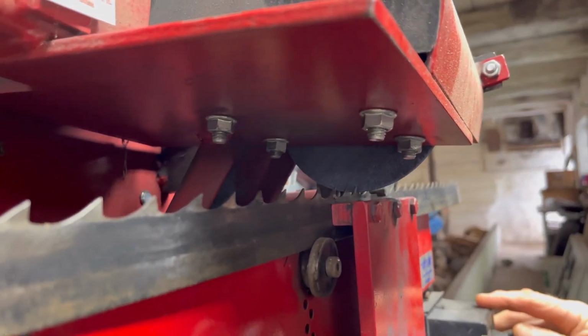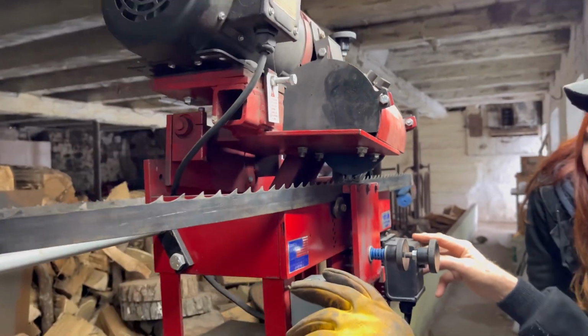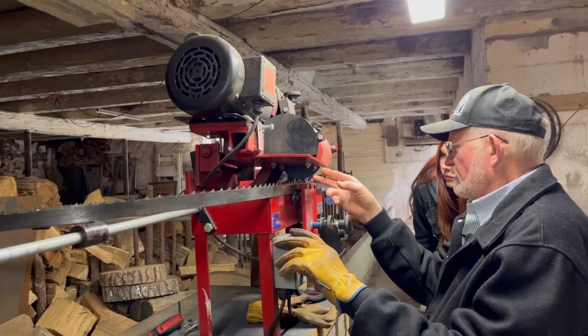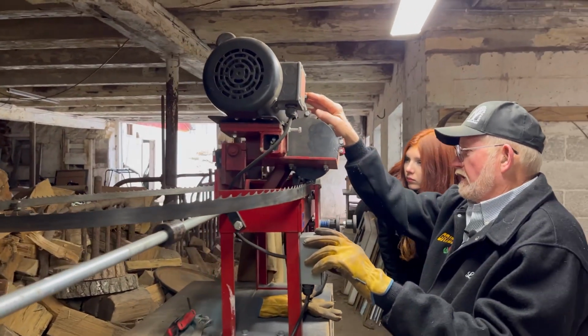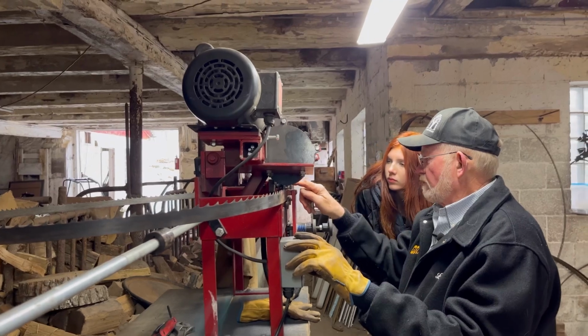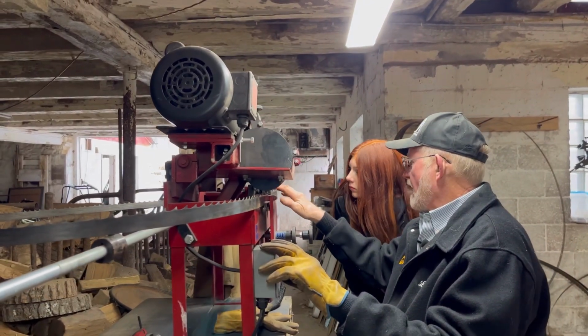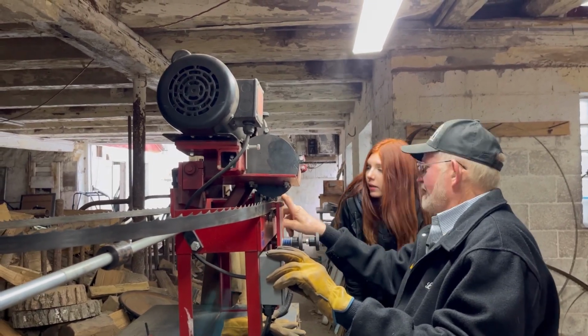Okay, that looks good. Now I'm gonna turn it on and I'm gonna let it down, and I'll adjust this arm until I'm just catching the bottom of this, and lower the stone enough that I sweep up on the backside. That keeps all your teeth the same height, because if you got one long tooth, that's going to be the one that's cutting. Yeah, right.